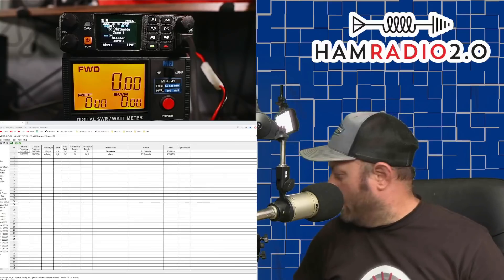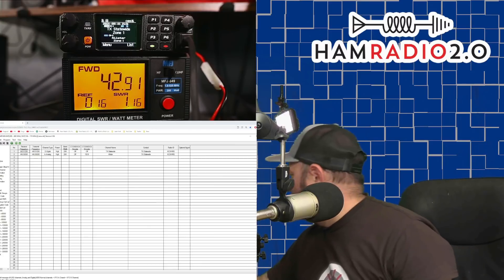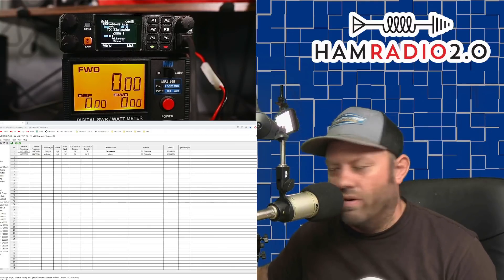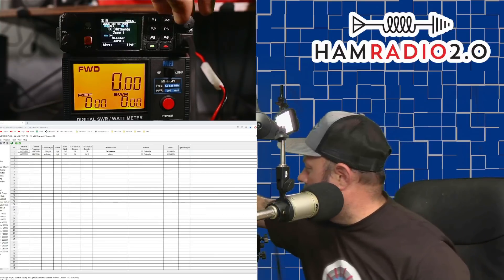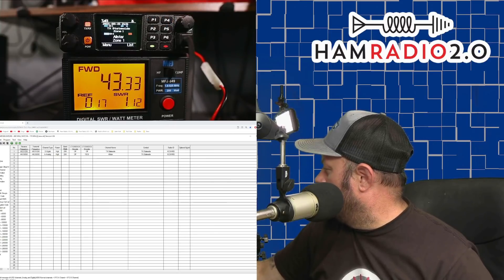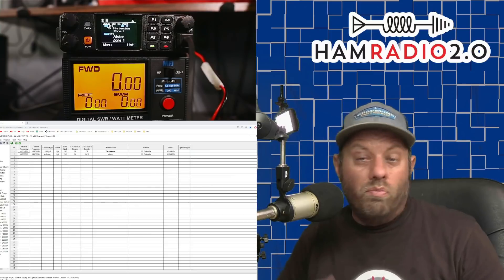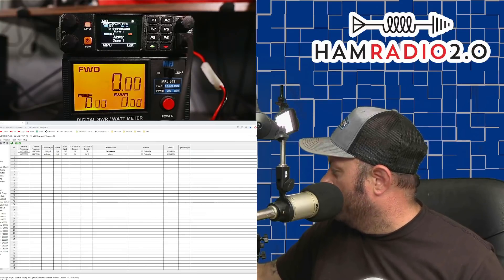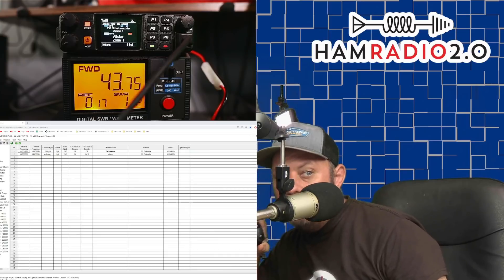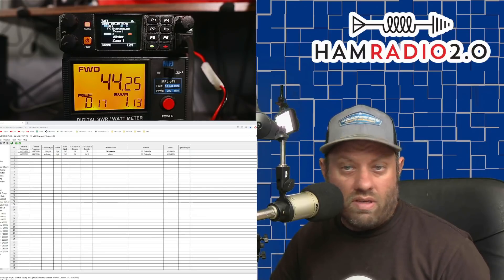There we are. Repeater not found — I'm too far away from the repeater because I'm on the dummy load. Let's see if All-Star works. Nope, too far away from the All-Star node also — because I'm on the dummy load. But both of the key-ups are working. Since All-Star is on 446.5, I can key up there. You can see it's pumping out about 43 to 44 watts on 446.5.